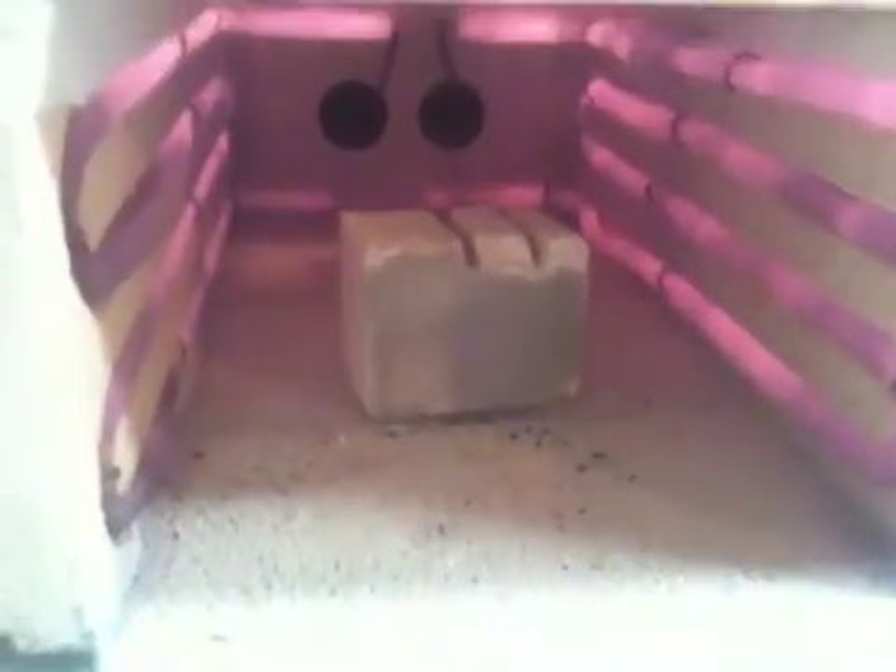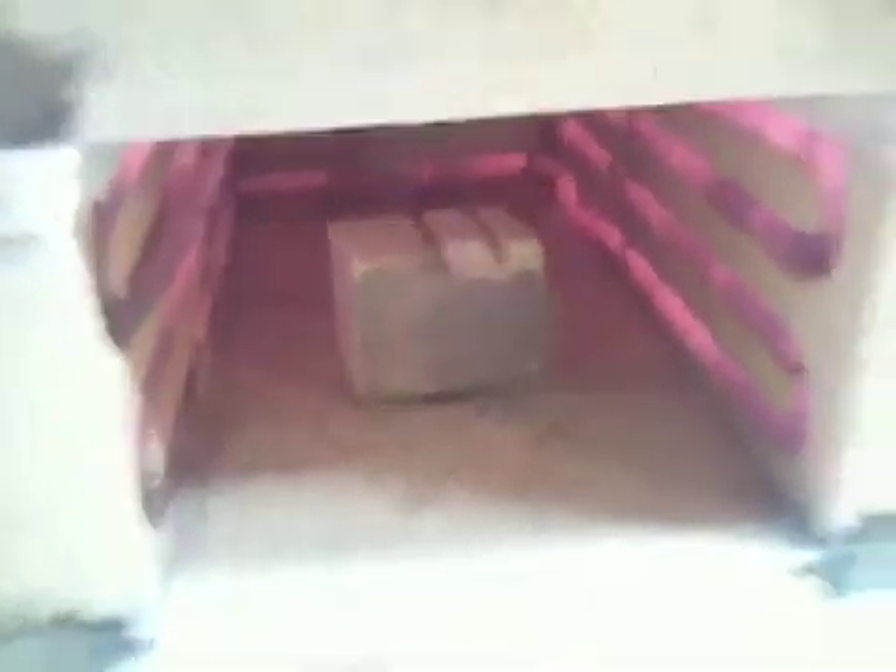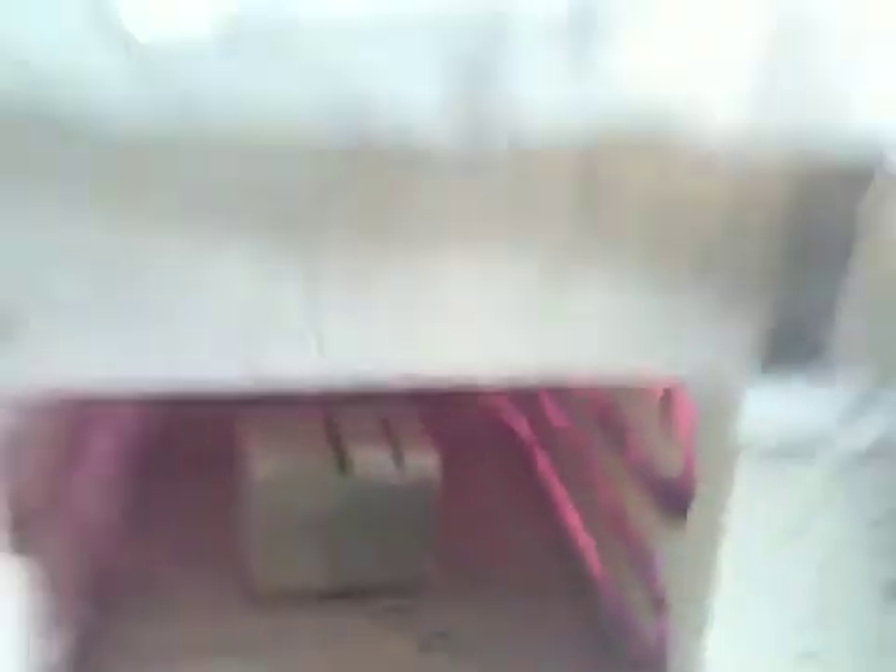But I just wanted to give a quick overview and talk about the plans I was making. As you can see, just within a couple minutes we're already at 600 degrees — and that's with the door open; had I closed it, it'd probably be up quite a bit higher. You can see it's glowing pretty hot in there. I do need to push the wire back in in a couple spots, and I'll need to staple that in using Kanthal wire in an unspringy state, which makes very effective staples to hold your element in.